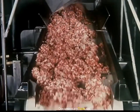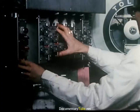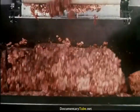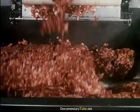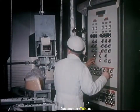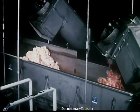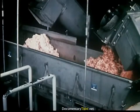Freshly ground meat arrives from the grinder. The operator handles the grinding, scaling, and conveying of meat to the blender. Blending is now taking place. The Hormel Batchmaster at the electronic control panel sets the standard formula on the dials. The feed augers are activated and the exact amounts of meat needed to make the prescribed batch are now brought together.